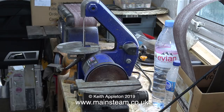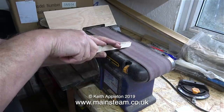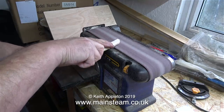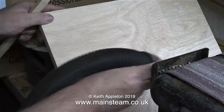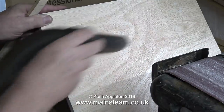Making the workshop work inside this large wooden shed — it's more or less complete, I just need to rearrange some things, hence this video. In the end I found this to be a good idea: the belt sander is the last one in the loop, it's on the left hand side now with a piece of wood at the other end, and this catches all the sawdust that the guard doesn't catch. I'm testing the principle with a piece of soft wood and as you can see, most of the sawdust ends up on the board, so it's a simple job to vacuum it off.